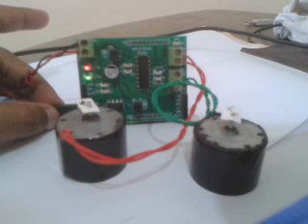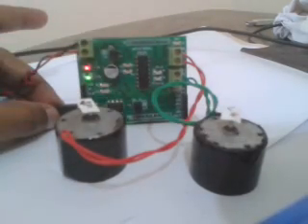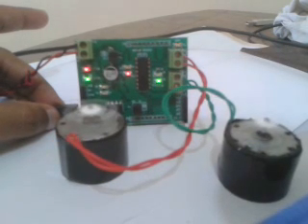For controlling two motors, I have connected an extra motor using the red wire to the motor_R terminal. By controlling two motors we will be using the L293D to its full capacity. Use the 'L293D dual motor controller' .C file from the zip file available on my website. Compile the code and run it by pressing F5 — the two motors will rotate in one direction, stop, then rotate in the opposite direction.